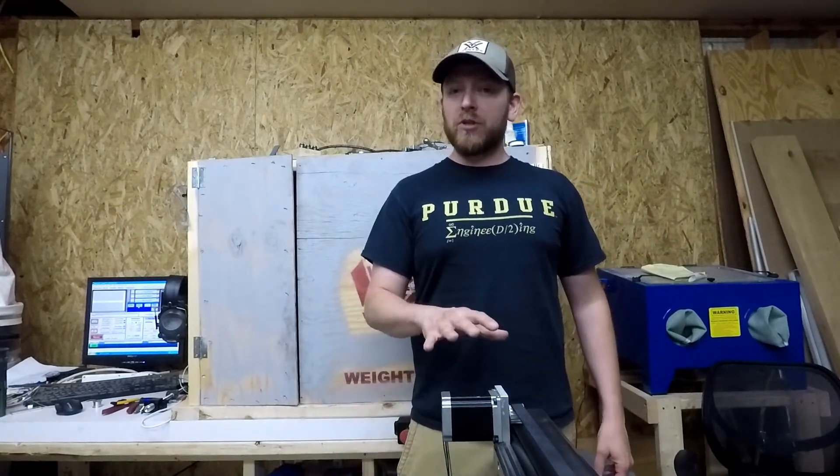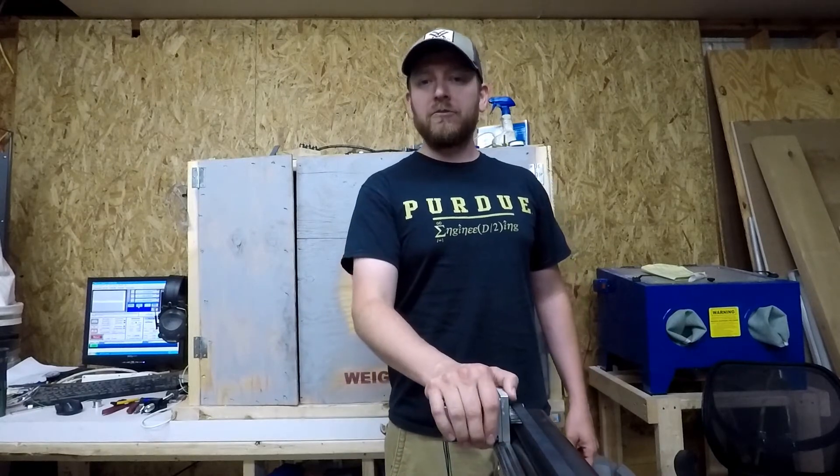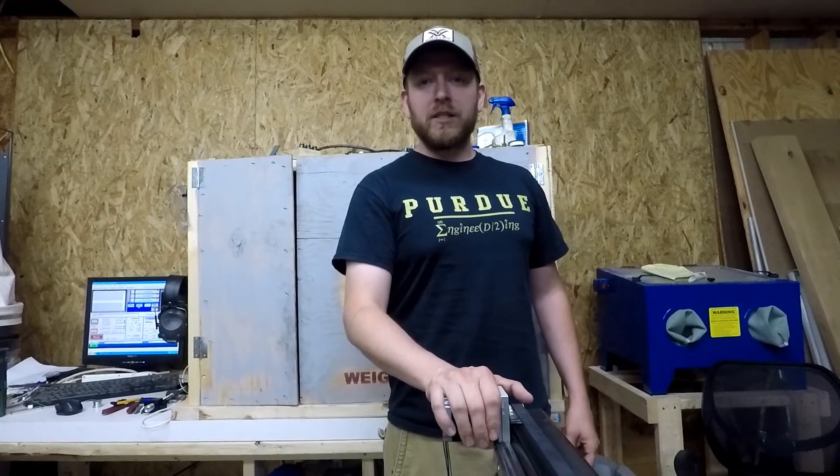I've been doing a few things with it. I just got this axis running. I don't even have the rest of the carriage built for the actual slides on the gantry, and I don't have the Z-axis built. I just wanted to finish this up. The big reason is because this is basically a proof of concept. I want to make sure that this belt drive system is going to be accurate enough to give me the results that I want. And I'm kind of finding that it's not.